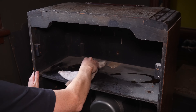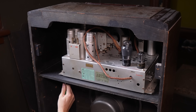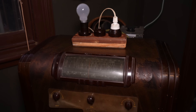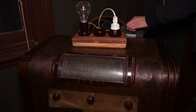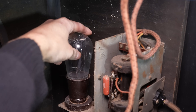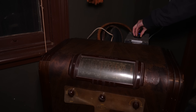I'll give the inside of the cabinet a clean before installing the chassis. There's even remains of some wax that has melted out of one of the old paper capacitors. After fixing the chassis into place using four bolts, I can connect the power lead and speaker to the radio. I initially powered the set on using a variac to slowly increase the voltage while running the radio through a homemade dim bulb tester, which is used to limit the maximum current the radio can draw and protect it against catastrophic damage. The light bulb was glowing brightly and staying lit, indicating a fault or too low a wattage globe. I removed the inbuilt light globe, and as expected, the radio ceased to draw any current at all. On the assumption this bulb was acting as its own dim bulb, I ditched the tester to rely only on the variac. It lit up and even had some hum from the speaker, but there was still no audio.